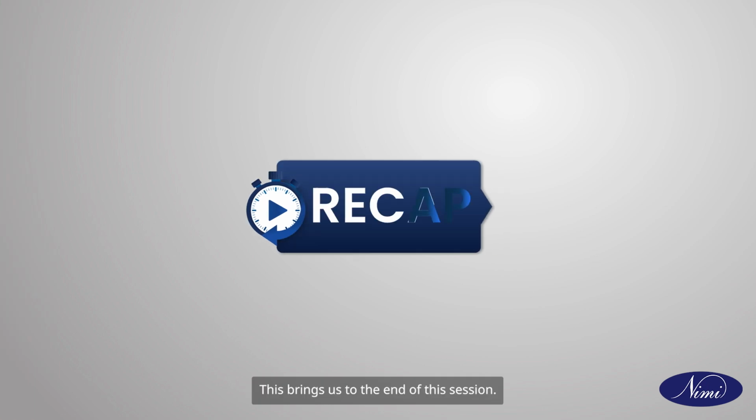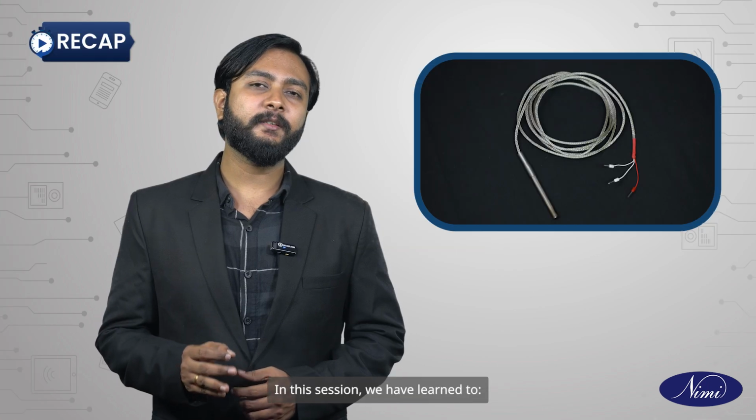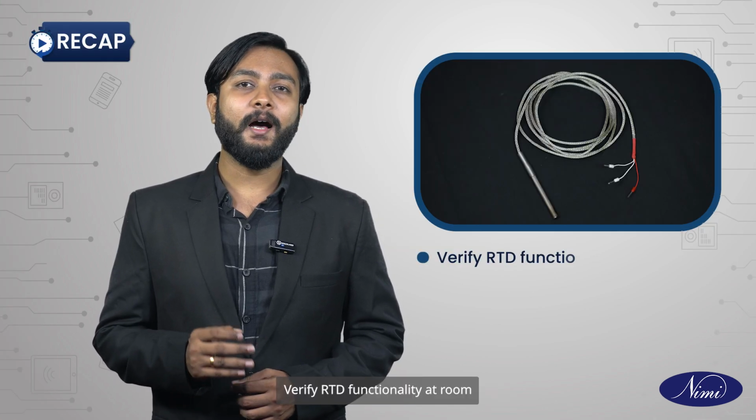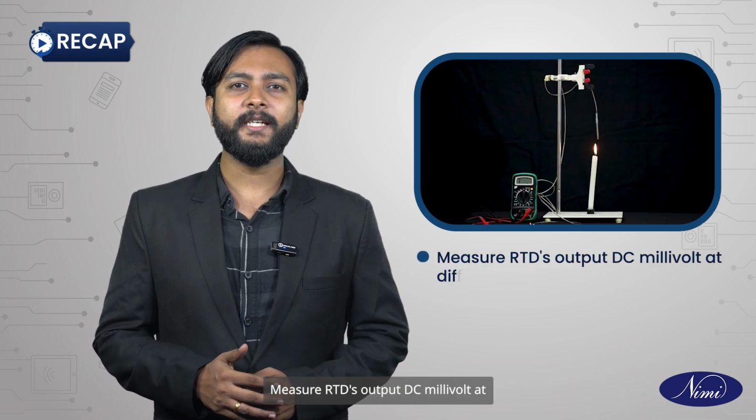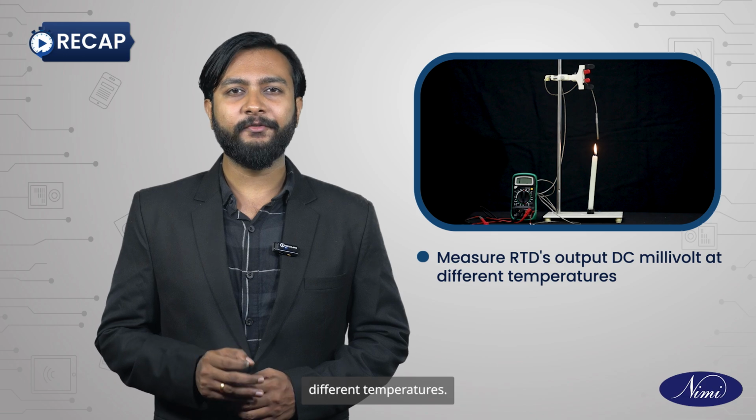This brings us to the end of this session. In this session, we have learned to verify RTD functionality at room temperature and measure RTD's output DC millivolt at different temperatures.